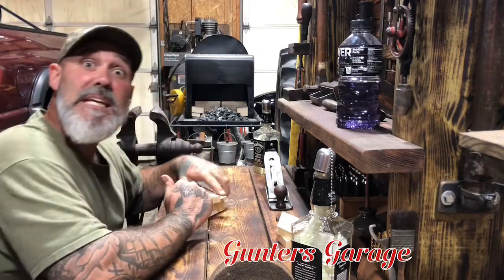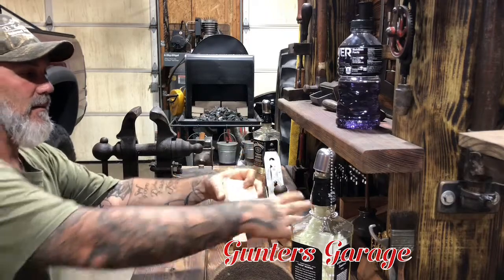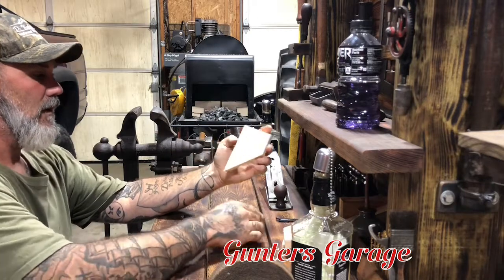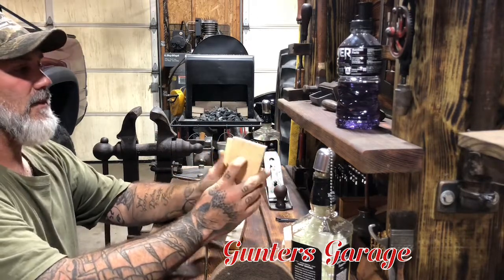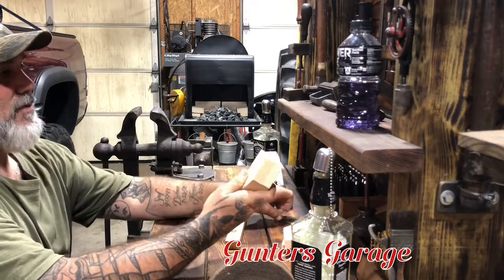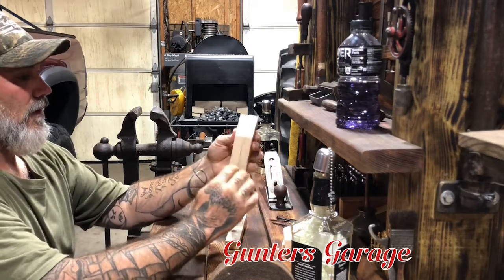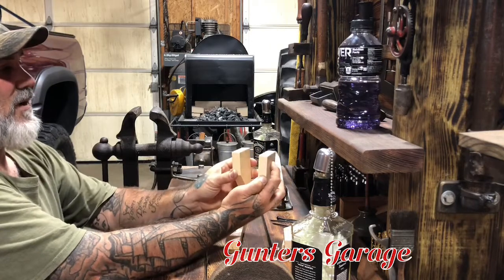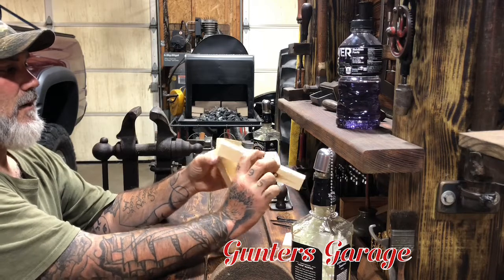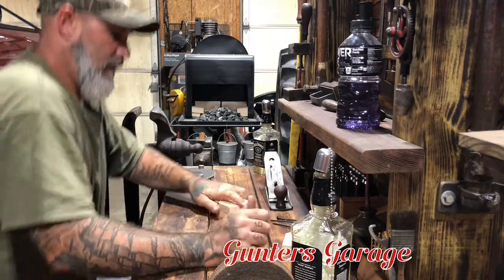Okay, plan B. I'm going to take, I already pre-cut these. They were little slats like that, and I pre-cut them. So take these guys like that, and I'll drill through them this way. Have to counter drill a little bit so I can get the screw into it. Here and here, however far apart, probably that far apart. And then I'll cut this guy off and that'll be my front piece and that'll make my pocket to hang it in. So, all right, let me get this finished up.